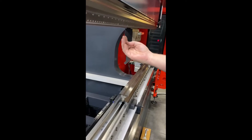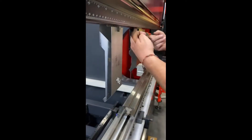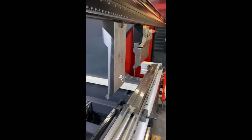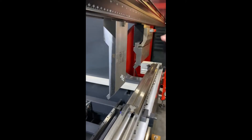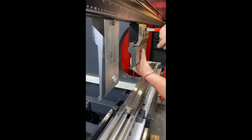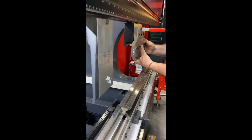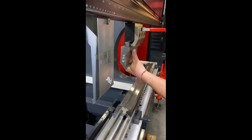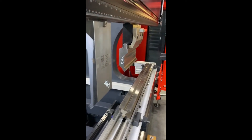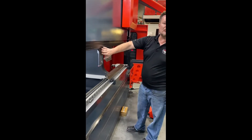We're building adapters that go from new standard to American. This is new standard — when I clamp this, the section clamp is clamped. So I've got American tang, and this is actually reversible, even if you've got a safety tang. You could have a bunch of these on your machine and be able to use your custom tooling or your own American tooling when you've got new standard tang.